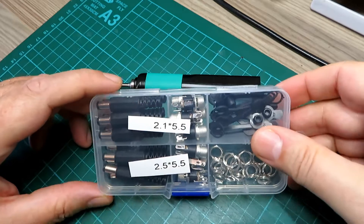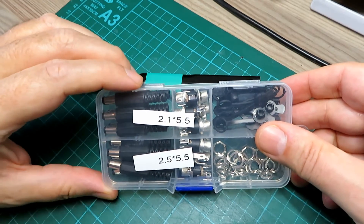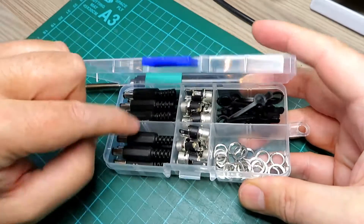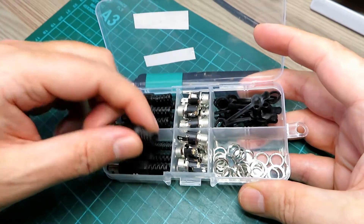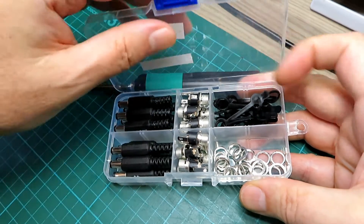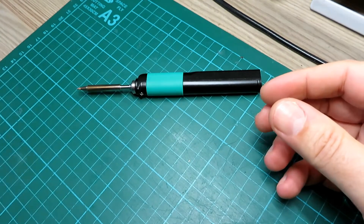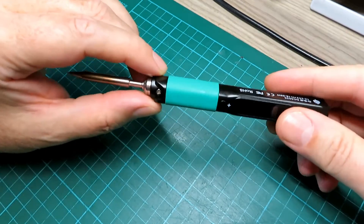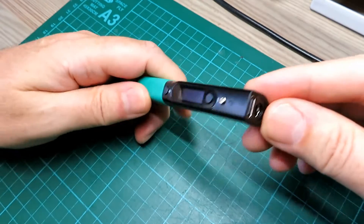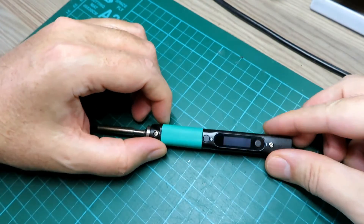It is super useful for the iron to be powered off USB-C, but you'll need a quick-charge type USB charger that can provide the kind of power for the maximum power output the iron needs. I would suggest picking up a 2.5mm plug such as these cheap ones on Amazon and just wiring up your own lead. I've done that with mine and it makes such a massive difference. There's currently a review of this iron by SDG online where he sort of slates it for not warming up quick enough and not being powerful enough, but the guy's running it off USB-C. Run it off the jack plug — you can see the jack plug in the back there — and you'll see just how quickly this thing warms up.